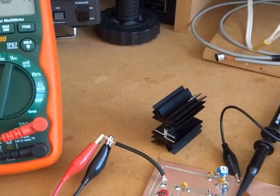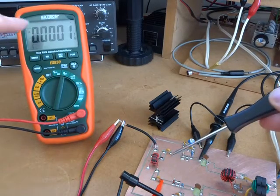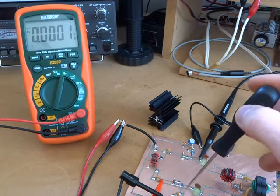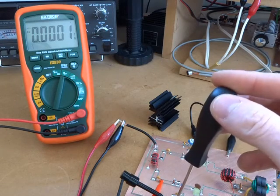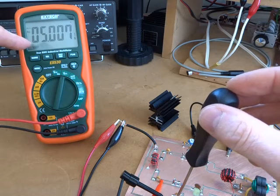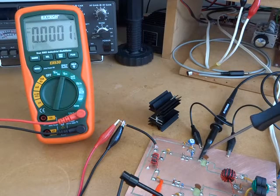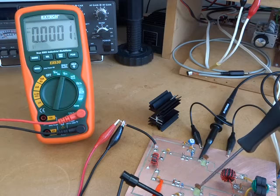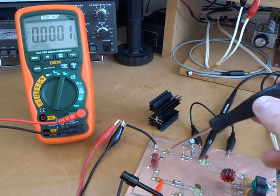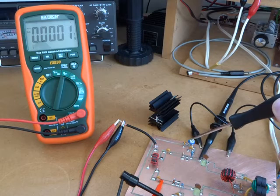The only other thing to look at is the ability to quickly check the biasing voltages. Up on the meter, we're just monitoring the output of this particular variable pot here, which is providing that DC biasing. Anti-clockwise is minimum, and as we wind up we get more voltage coming through — up to, as expected, our maximum of around four to five volts. If I transfer that to the other side, I can test that one too, and that was working fine. Using these two 1000 picofarad capacitors is a really good way of confirming that the circuit is at least electrically connected together. It confirms nicely that those two trim pots will provide variable DC bias to the gates.